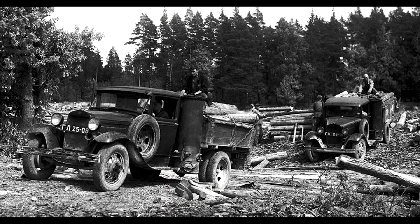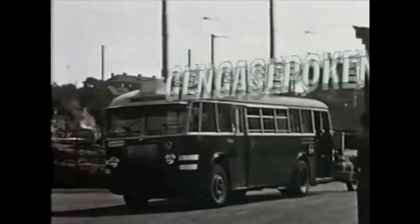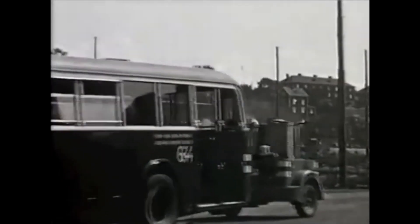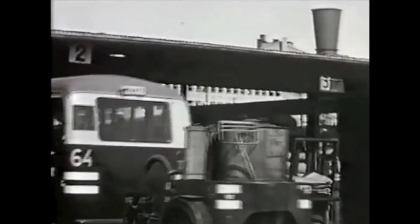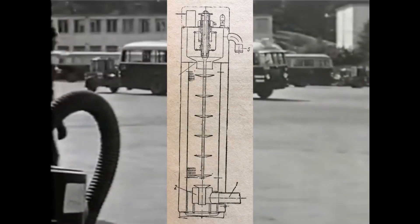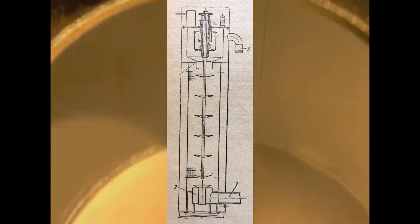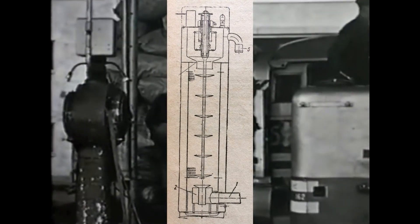A 20–25 watt power supply was used to feed this electrostatic filter. The corona current was 0.1 to 0.2 milliamps. A transformer converted 6 volts to 35,000 volts. Note how little energy this electrostatic filter consumed at a heavy load of 60 cubic meters of gas per hour. A thick corona electrode would not cope with gas purification — the mounted plates of thin material did all the work. The corona electrode is made of a 20mm tube, on which 6 plates with diameter of 160mm and thickness of 0.5mm are mounted. The precipitation electrode is made of perforated sheet 1.2mm thick, with hole area of 76%.